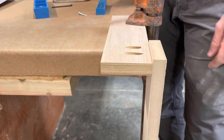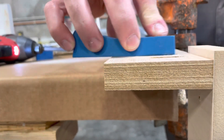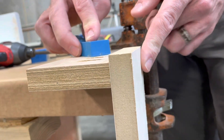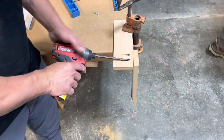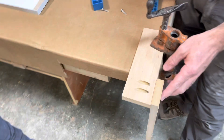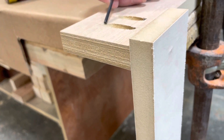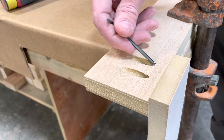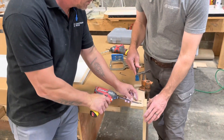We're going to do the second one with our standard inch-and-a-quarter pocket hole screw. Now here's the deal — it's not as far below the surface as we would like. And you can see the pocket hole screw sticking through. So when you have the proper oblong-shaped hole, a standard inch-and-a-quarter screw actually goes through the perpendicular surface. But the screw head is nicely below the surface. So let's do one last example — take a bolt out and just leave it in the hole.